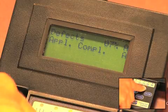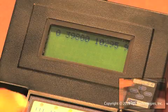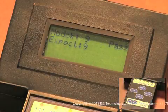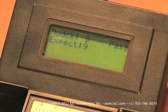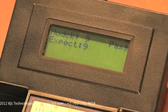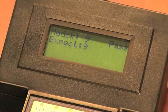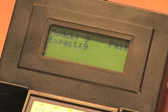After the application compliance screen, the data encoded into the barcode is displayed. Pressing the select button will bring up the modulo check character, which is a method for the scanner or verifier to determine if the scan was valid. For a UPCA, it works by running the first 11 digits through a mathematical calculation to get an expected mod check character, then scanning the 12th digit and comparing it to the scanned mod check character. If they match, it is a valid scan, and if not, the barcode is graded F.